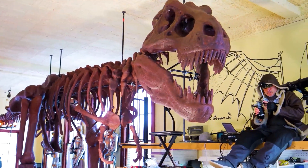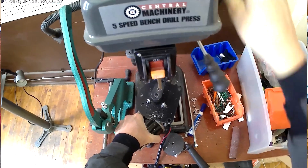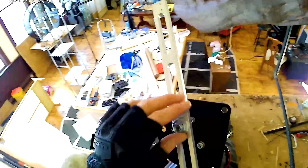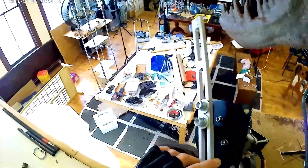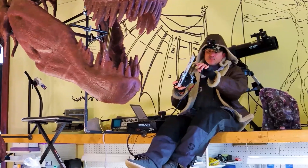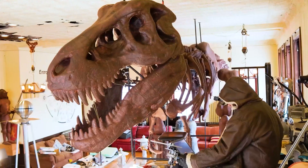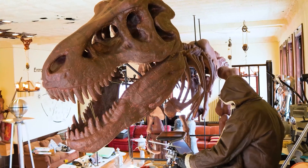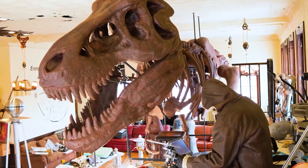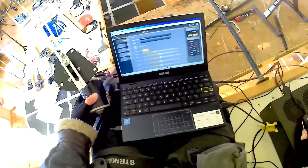It is the morning after. Welcome back — we've made some modifications to our little motor from yesterday. We drilled an extra hole in the arm and attached this scrap piece of aluminum, which acts like an adjustable arm that we can fine-tune to control how much of the pulley string we can pull. It's hooked up here and we're going to try to control it with the mouse through this interface where the motor acts as a servo controlled by a computer.